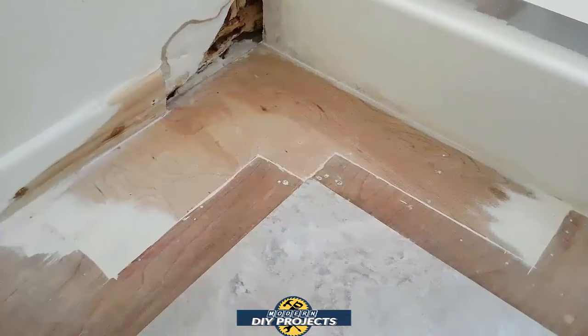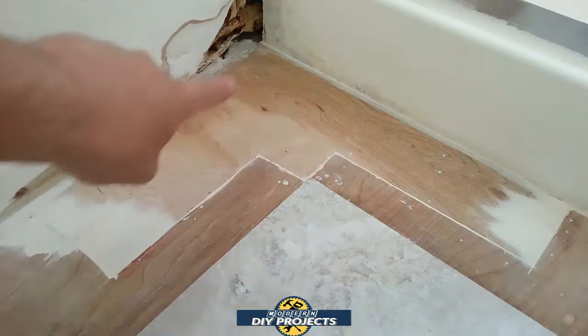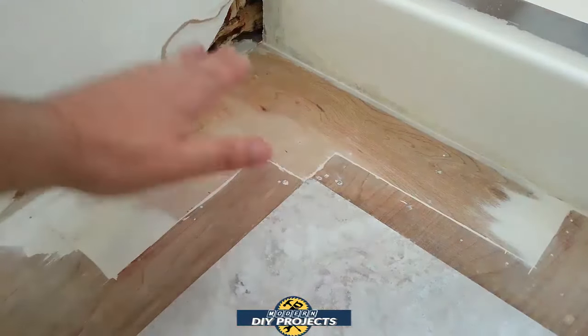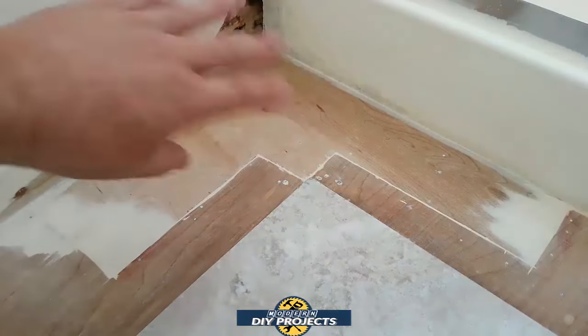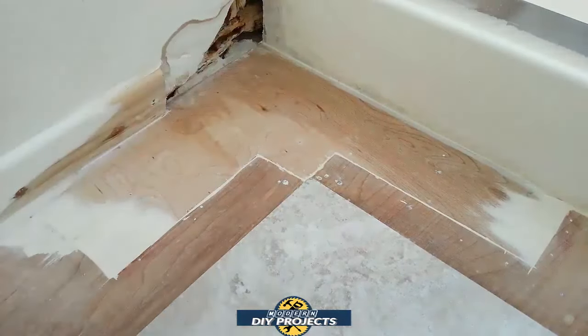When the bondo was dry enough, I sanded it and smoothed it out, then I cut a piece of plywood to put on top of it and installed it right there. I put some filler around the edges so we don't have any unevenness telegraphing up to the floor — everything's been smoothed out and filled into the wall back there. Now all we have to do is put the floor tiles on top of that and continue fixing the wall.